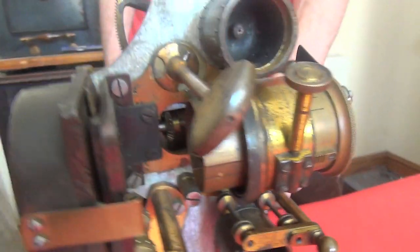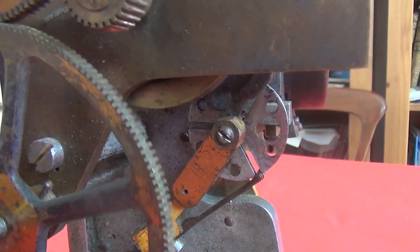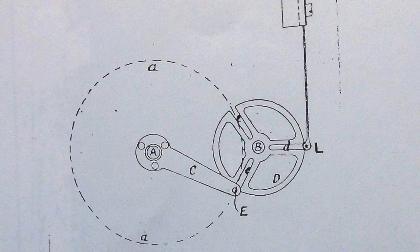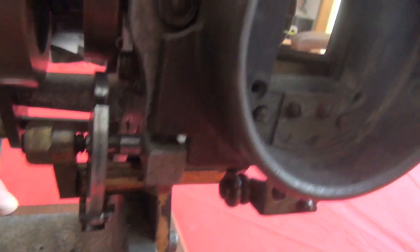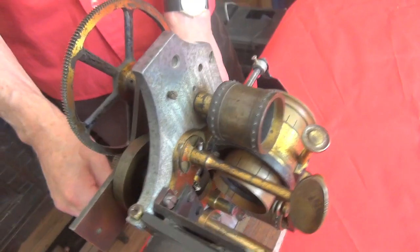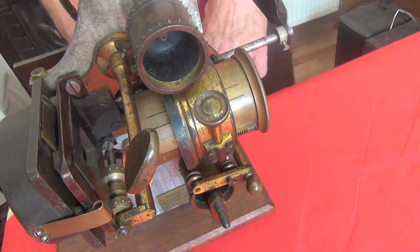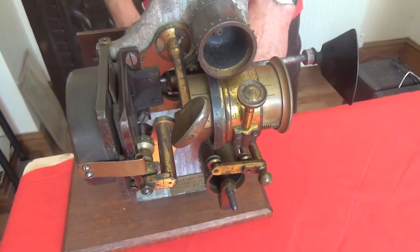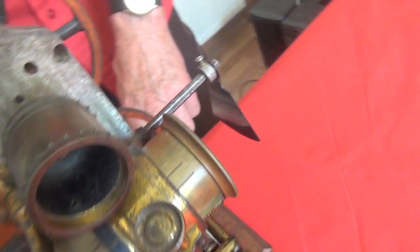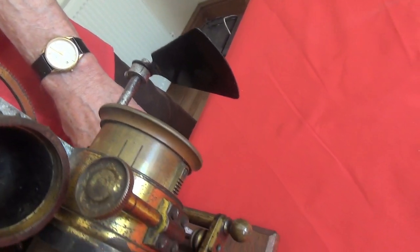What's very special about this, Lester? It has only got three cut-outs on the star mechanism — what we might call a star mechanism — even though it's got three slots but not the usual crescents. We'll go into more detail with some close-ups in a minute. Essentially the reason for three is that the acceleration rate, or the pull-down rate, is increased, so there's less of a blanking period on the screen. You see each picture for longer on the screen and the pull-down period is reduced. Hence the shutter is very small, almost like a knife blade — a small section of that 360-degree circle of the shutter.